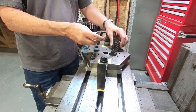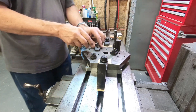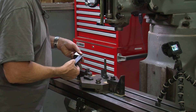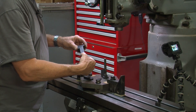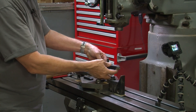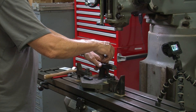These step blocks are interesting because you can use them like this or you can actually use them like this. Here's the actual clamp — you can see they all have notches and they'll sit in a step block. They're at a little bit of an angle so they actually grab in there pretty well. Or you can set it up so the work piece is out here. You want these as parallel to the surface as possible, and this follows up with a flange nut. Sometimes if you don't have enough thread there you can take a smaller step clamp and put it on top.